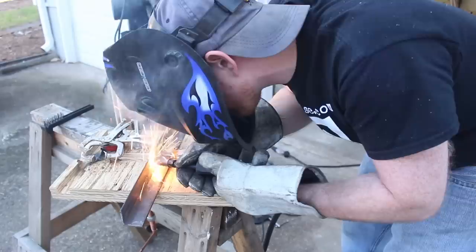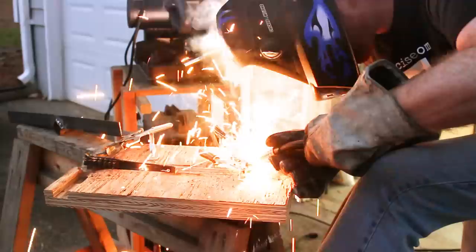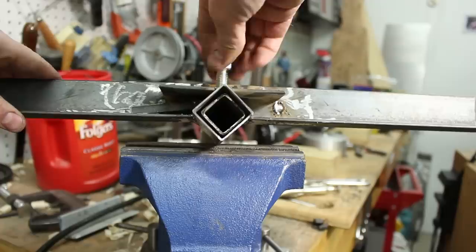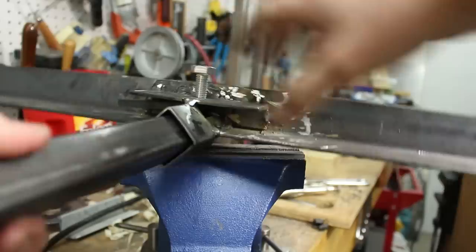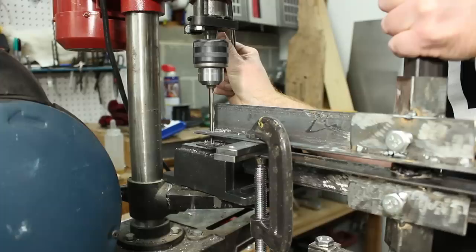After I had the upright support welded into place, I cleaned it up with an angle grinder and turned my attention to fabricating the upright wedge. This little piece along with its handle is inserted into the upright guide, and it provides a bearing surface for the upright lock bolt so that it doesn't mar up the surface of the upright and can effectively transfer the clamping pressure. One thing I'd recommend is to add a nut to the upright guide support so the upright lock bolt has a little more meat to bite into — eighth inch angle iron with threads cut into it may not have good durability over the long term. I mounted both ribs onto the upright of a single clamp to fixture them so I could match drill them. This allows the holes to align so that when I install the rails, they will be parallel.